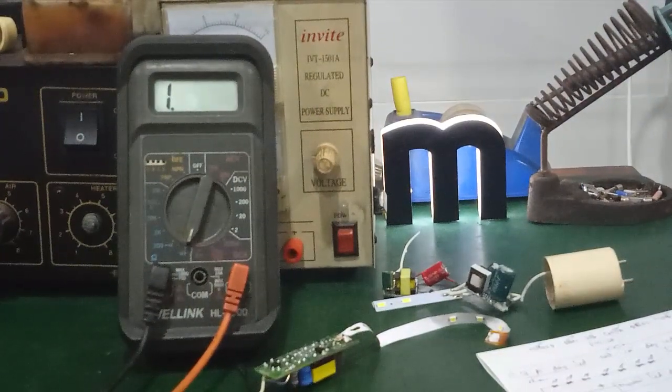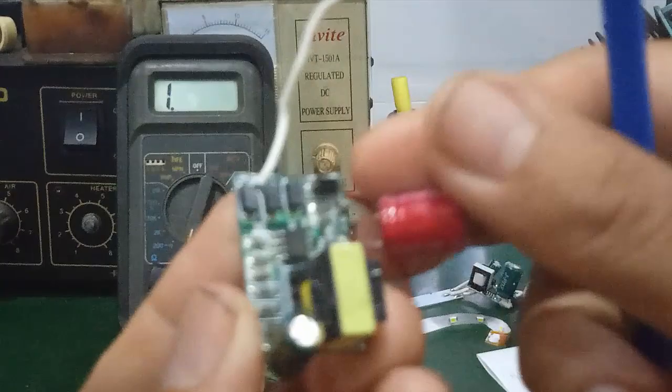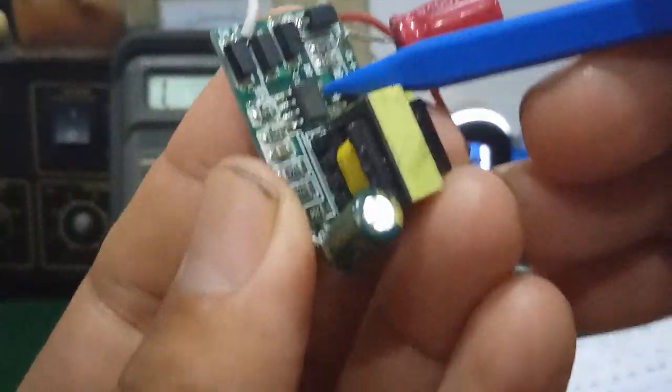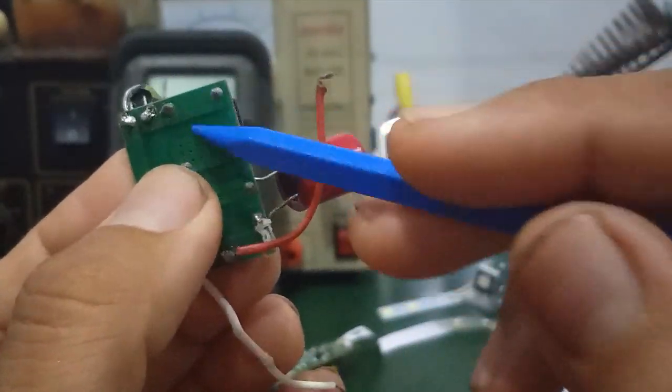That covers the LED strip or LED bar section. Now for the LED driver power supply, there is a difference compared to typical LED driver boards on the market — like those from Tiến Đạt Đông or Điện Quang brands. The Philips lamp uses different components. This is the LED driver board that other brands commonly use — it uses an 8-pin IC LED driver with a coil assembly, not a flyback transformer.